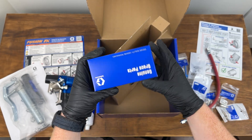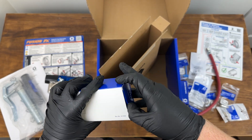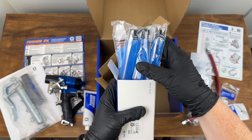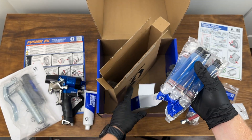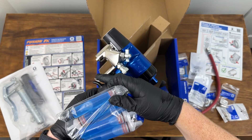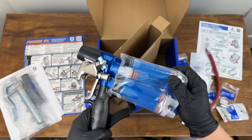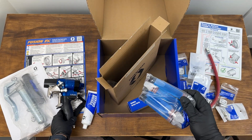Part number 256384 contains six clear shot cartridges. As mentioned, this gun can be configured as CS (clear shot) or AP (air purge). The CS cartridges go into the handle of the gun, and when you let off the trigger they sheath the chemical through the chamber, helping keep it clear. This is really handy for people doing big open spaces who aren't letting off the trigger often — it keeps the chamber much cleaner and you have to drill it out less.